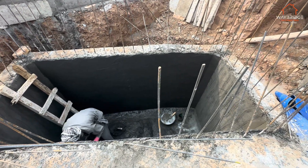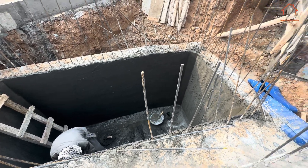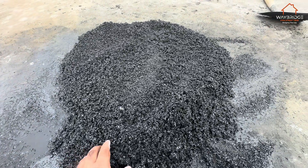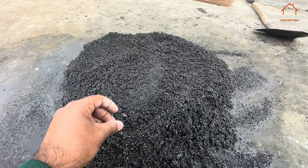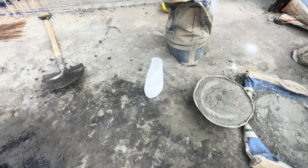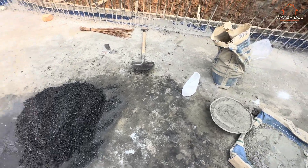After the plastering, we're going to be doing zero chips — what we call it in Pakistan. That's basically this here. This is fine chips; just add a little bit of water to clean it out. That gets mixed with cement and this hydrophobic powder. This is the first process of water sealing the septic tank.